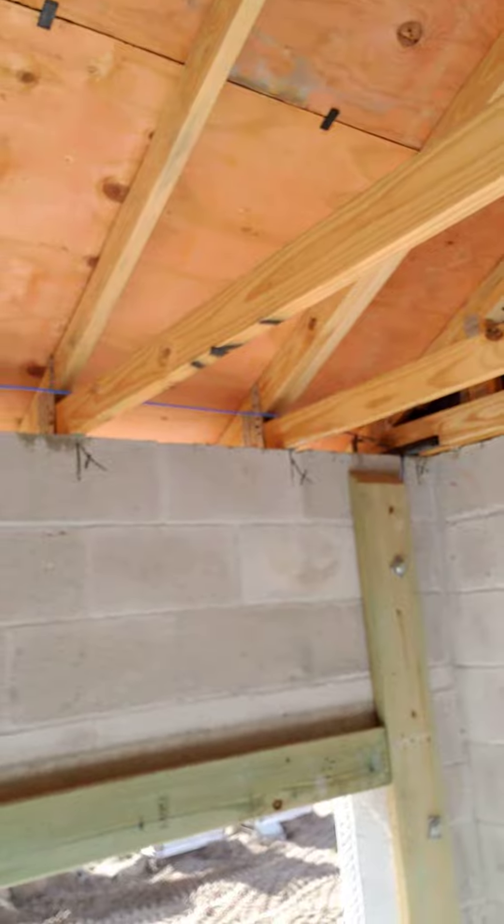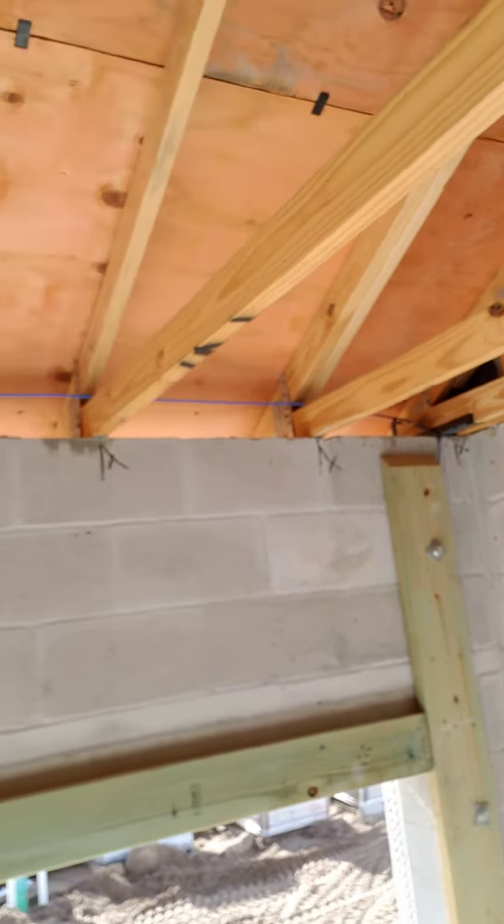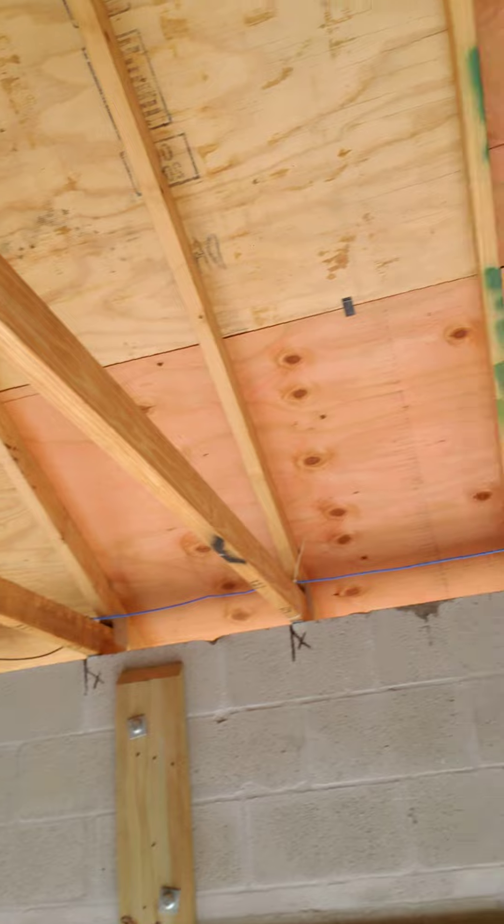That's the embedded strap — clearly they have the minimum nail requirement, which is only three nails. If you're in Florida and you ever hear of the 'third nail,' that's what they're referring to: how many nails are in the straps that fasten the truss system down. Why the builder shorted the straps, I don't know — there's really no reason to. This is not a tall truss; it's pretty much standard truss framing and it should wrap over the truss so they get the maximum credit.